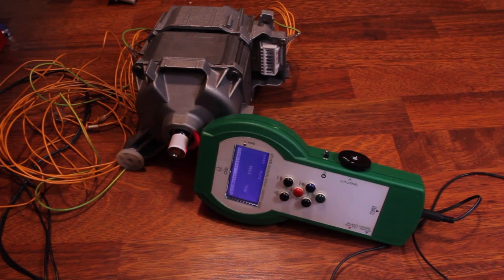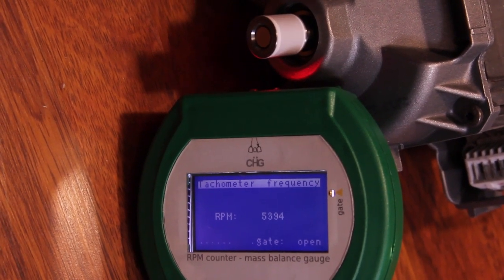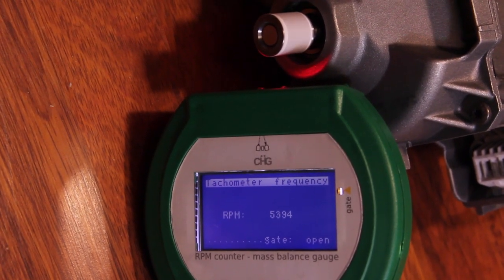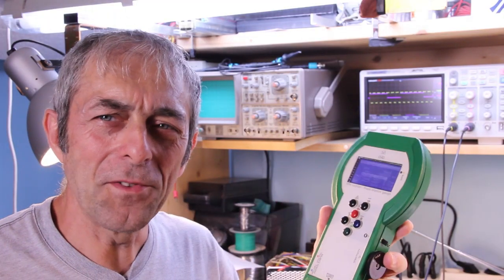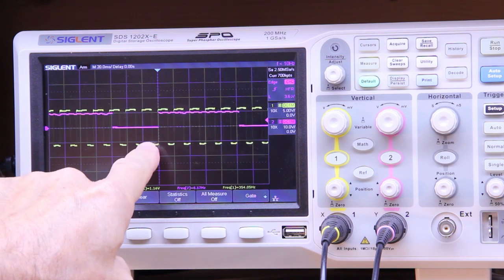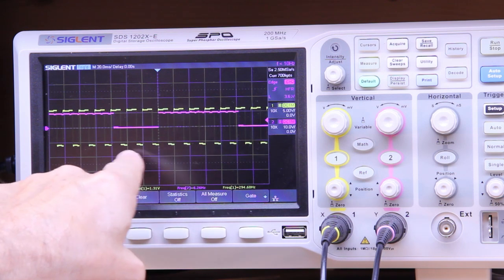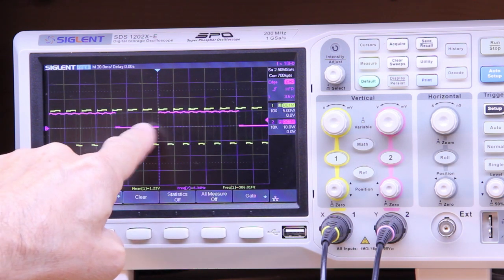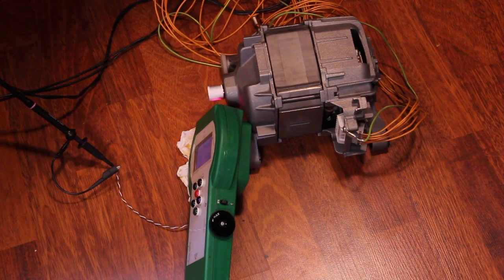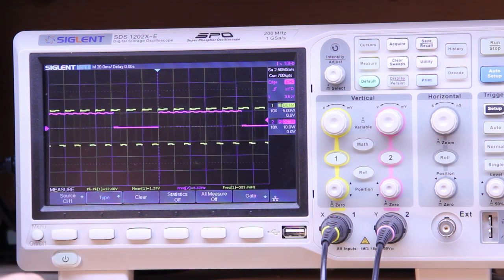As you can see, the speed can reach very high speed. We are at 5,400 RPM. And if you want to learn more about this instrument, you can watch the video, link in the description. This is the signal read after the yellow track, after the zero cross detector. It is the frequency that comes from the tachometer, and the pink track is the signal that comes from the RPM counter, the instrument that I put to read the actual speed of the motor, and that provides an output signal from the photosensor.